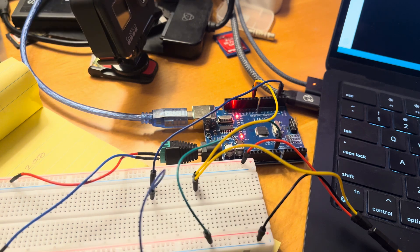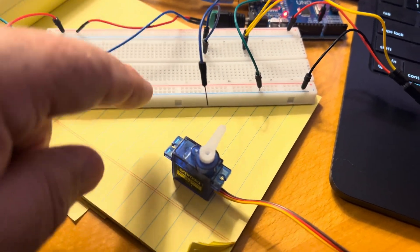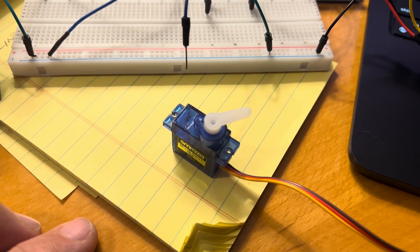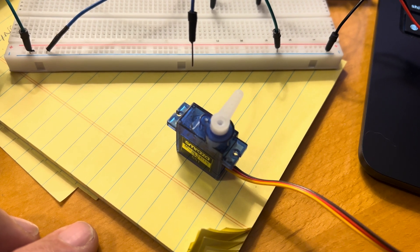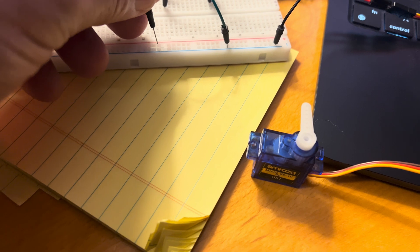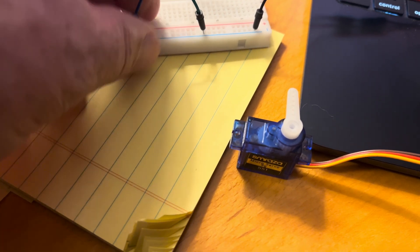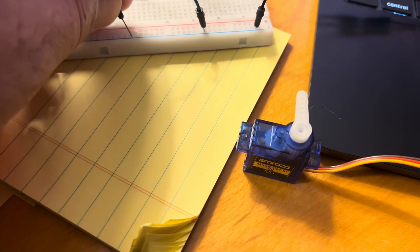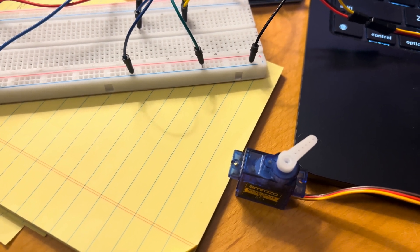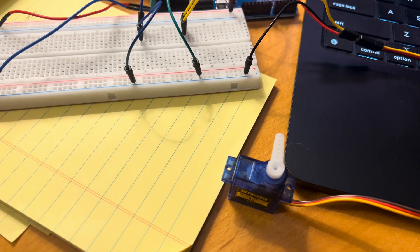Over here the Arduino — let me disconnect it from the computer, that doesn't matter. This wire here is a push button on the side of the board. So when this button goes to ground, did you see the signal changed? It'll change back again in a minute. There you go. So this will attach to a signal — a push button at the side of the track. When you push this wire in there — so I'm grounding that wire — the signal will change. In the ground hole. Now the signal's up. And after a little while it'll go back down again. It's up for 10 seconds. You push the button, it goes up — train can depart — and down it goes again. If you leave it that way, it'll just repeat the process after a period of time. There's a loop.